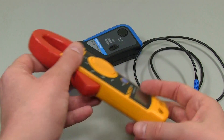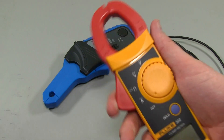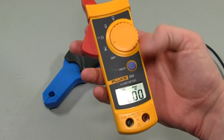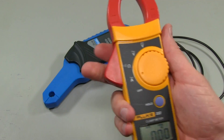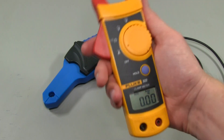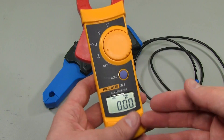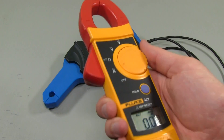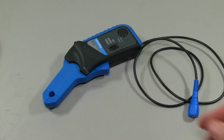Something like this is a more traditional current clamp - this is a Fluke 322. You just put it around a wire, click it on, and it'll give you an amp reading. You can see here amps AC and it can also do volts. If you're looking at the amps, you just go into a switch panel or distribution board and clamp onto a circuit - you can see the amps coming through it instantaneously. The refresh rate isn't amazingly fast but you can sort of see what's going on as you look at the screen.